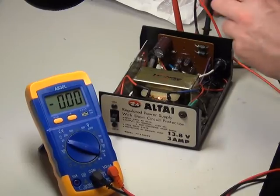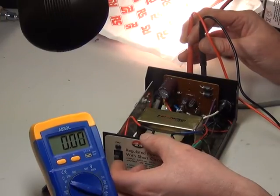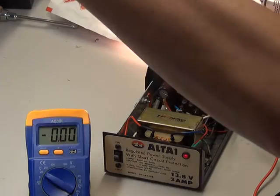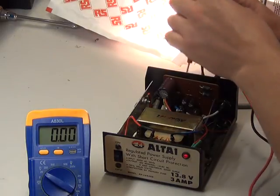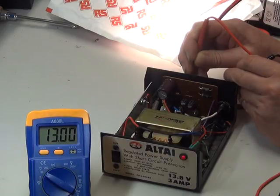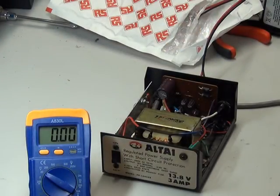Hopefully when you switch that on — there you are, you can see our car light bulb has lit up, and we've got the fluorescent light on at that load. On a two-amp load, it's dropping to 12.98–13 volts. That's fine. So there is another power supply rescued — simply the three capacitors, some rewiring, and an improved fuse holder. That brings the old 1981 Taiwanese power supplies that got banned up to a safe standard, and with those new capacitors it'll be good for another 2,000 hours use. Thank you for watching.